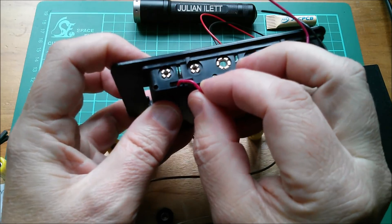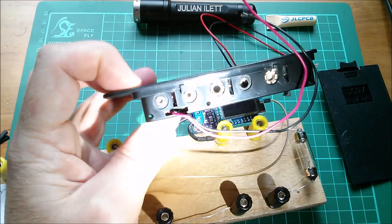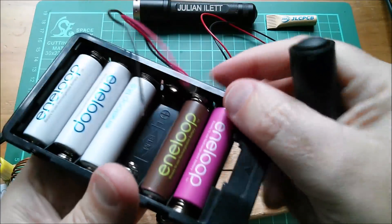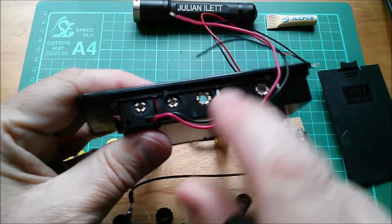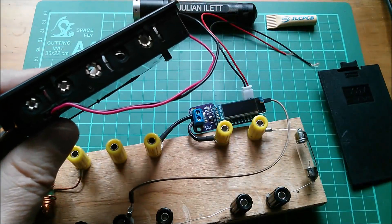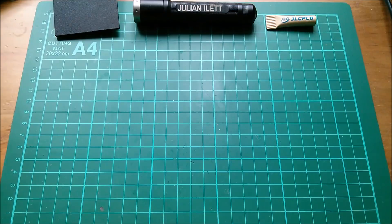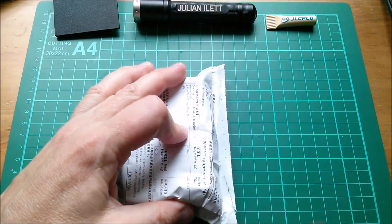The wires are actually attached — they're crimped to metal contacts riveted inside the two connections, so they won't replace easily. I'm just going to have to make a wire join and put a bit of heat shrink on. Let me move these to one side — I have another style here which might work as an alternative.